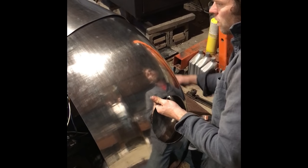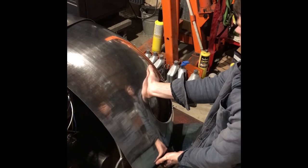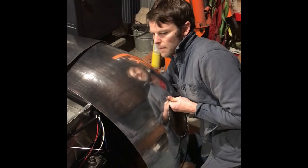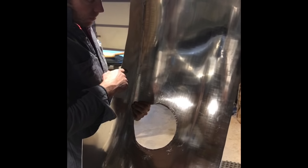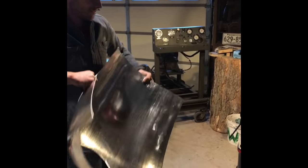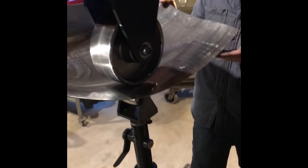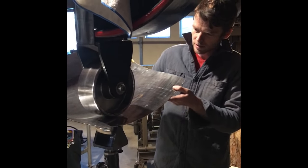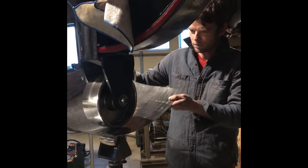The whole thing should be dropped back. So I'm gonna see if it'll let me do that. So I'm gonna work this reverse, stiffen that up, and that should bring this in a little bit. Fingers across too. And I've got the 5 radius in here. I've found that the sharper radius you use in the reverse, the more it'll kind of flatten the panel, it'll bring the panel to a less arc in it this way.